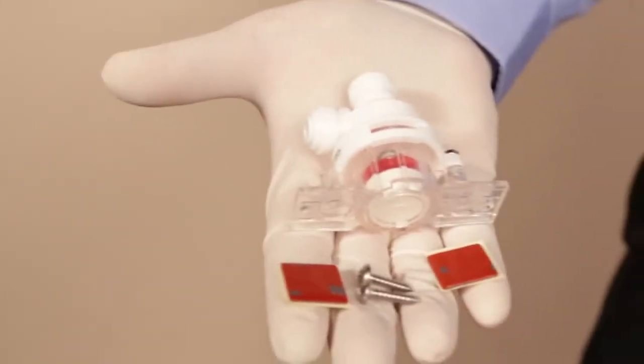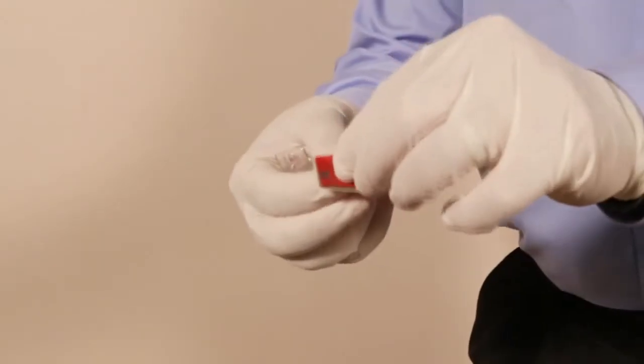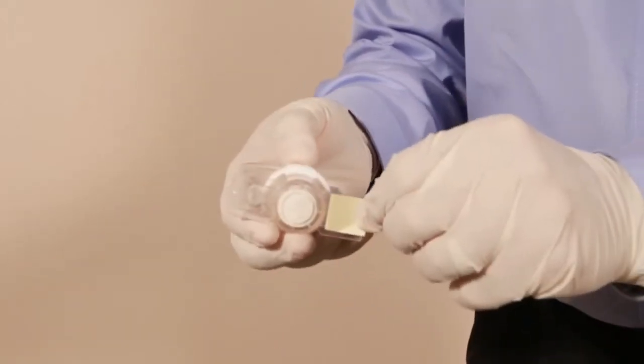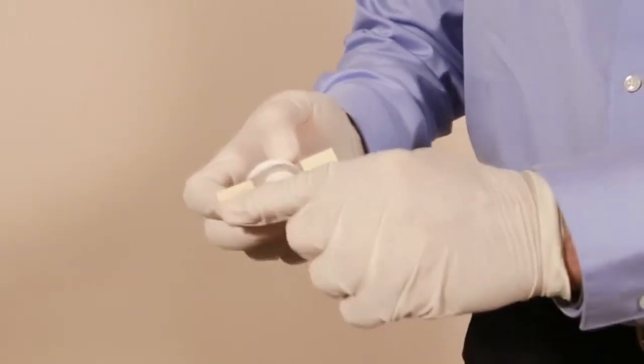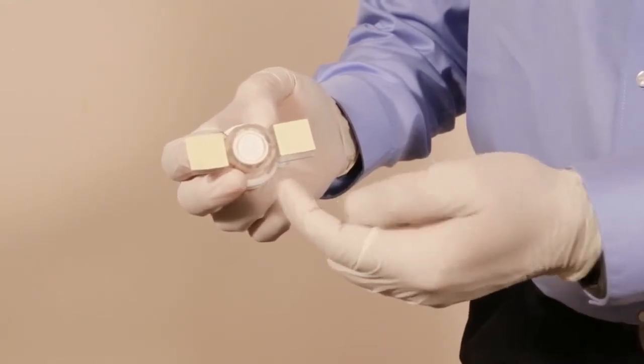The leak detector kit includes 2 self-adhesive mounting squares. These are used for mounting the detector in position. Peel the backing off one side of a square and place the square on one of the outside legs on the bottom of the detector. Repeat with the other square on the opposite side. Make sure you do not cover the absorbent pad in the center of the bottom panel.